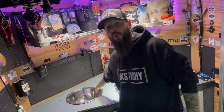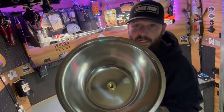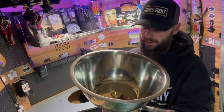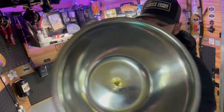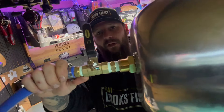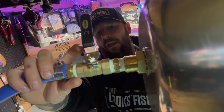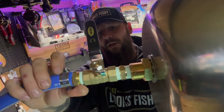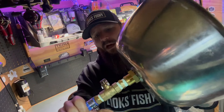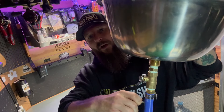Now that we got our hole pre-cut with our jigsaw, let's talk about the sink. This is a simple salad bowl from the dollar store. I drilled a hole in it at an inch and an eighth and used a bulkhead fitting to hold it together. I also added a union fitting, a shut-off ball valve, and a hose barbed fitting for the end. I went all half inch to give me the opportunity to fill up the sink and then open the ball valve to drain it.